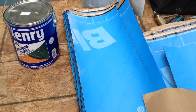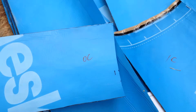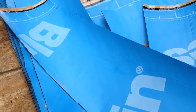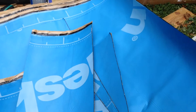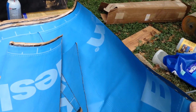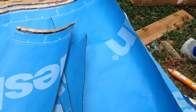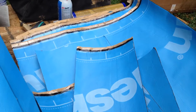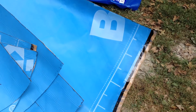What you want to do is cut a bunch of pieces for the various areas you're going to be covering. There are outside corners and inside corners, and you want to do those separately. You'll also separately seal the seam between the foundation wall and the footing with an extra piece, and then cover the whole thing with a big piece that covers the whole area that's going to be underground. You put this on vertically — I've tried putting it on horizontally to have fewer seams, but that's not what they recommend, and you can tell why if you try it. It's kind of hard to work with in large pieces. It's got a strip of adhesive on both edges, so as you put it on in sections, you overlap them and they all adhere to each other, so you get a good seal.